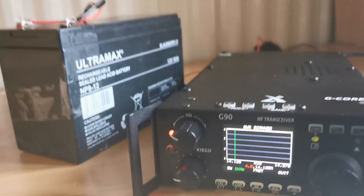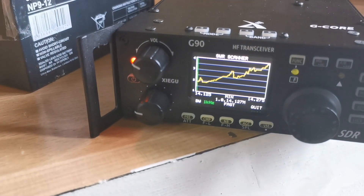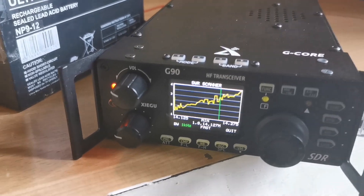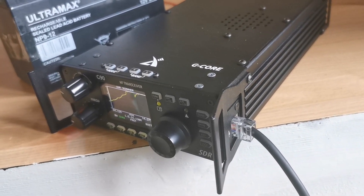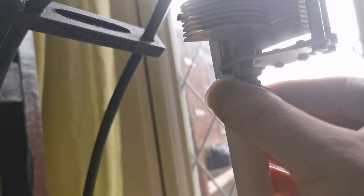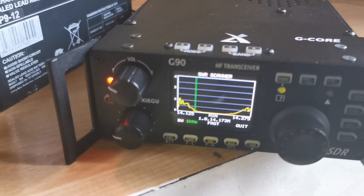I've got the numbers on the bottom for each band. It's still out at the moment — still showing four — so we'll come back and tune it a little more. Now it's come down. We went too far down the band, so I'll slowly move it again. You can see it's very, very sensitive. And there we are — I get pretty good bandwidth on 20 meters.